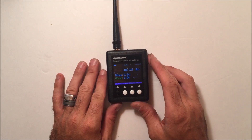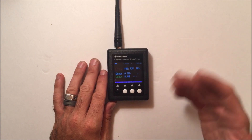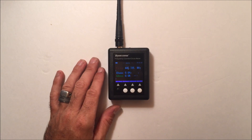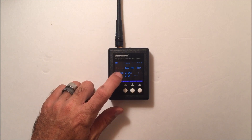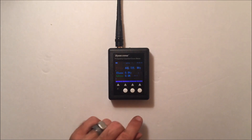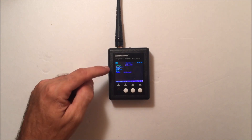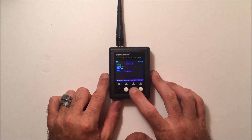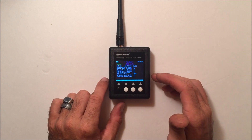It's a neat device overall. If you have a little FRS radio you didn't program and want to know its frequency, or you want to verify you're transmitting on the right frequency — for example, if you were set to 445.725 but reading 445.753, you'd know you're a little off. The menu button — first button, short press — gets you into the menu; long press is how you power it on and off.